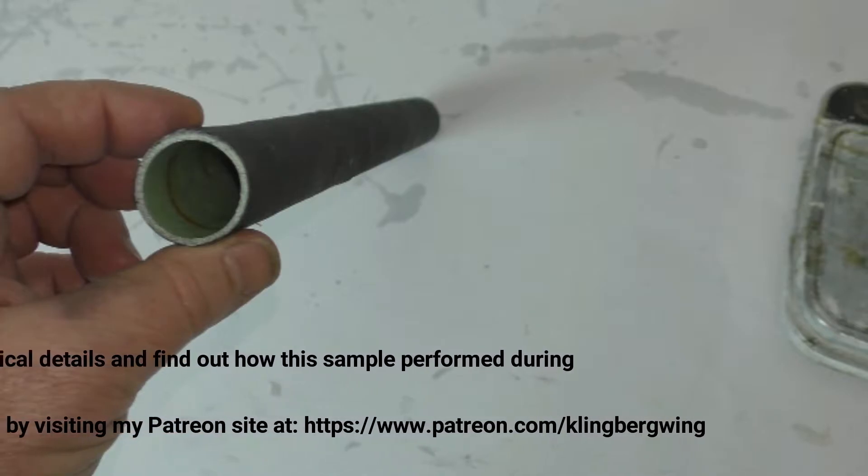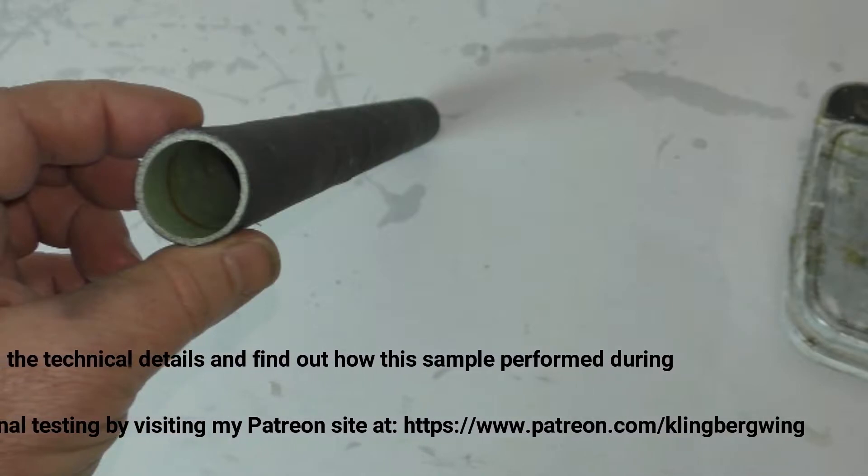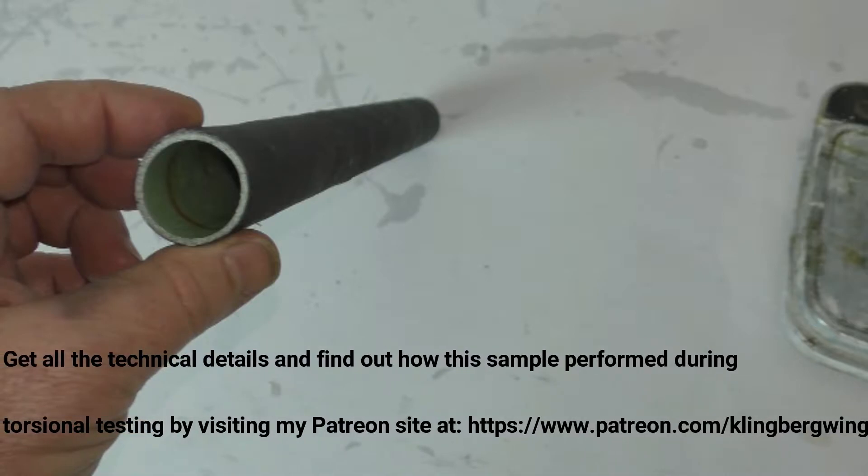The methodology I'm using is very similar to how you make composite tubing at home, except I've modified it so that it's a three-step process. You lay down one layer — or as many layers as you want — of a particular composite material on your mandrel, then you spiral wrap a strip of foam around that mandrel, and then over wrap it with other composite material: Kevlar, fiberglass, carbon fiber, as many layers as you want.